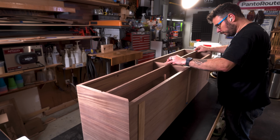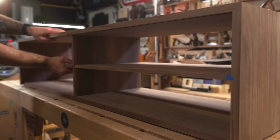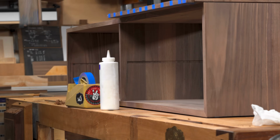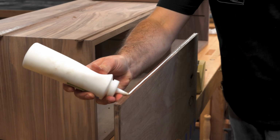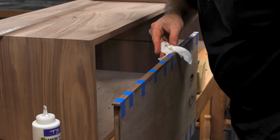The dust shelves on the right half of the cabinet and the shelf on the left get a continuous strip of wood that was taken off the front of the case when we first started, in order to give continuous grain that matches the case all the way across the front. Details, baby, details.